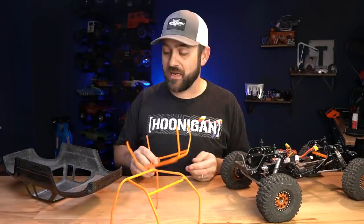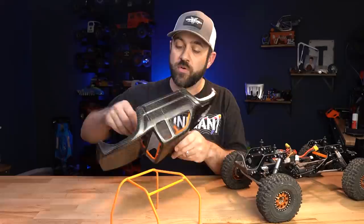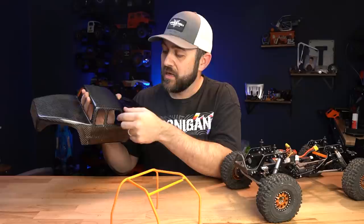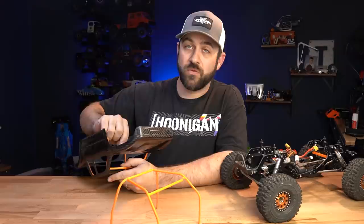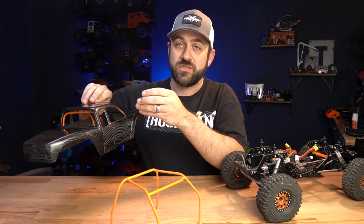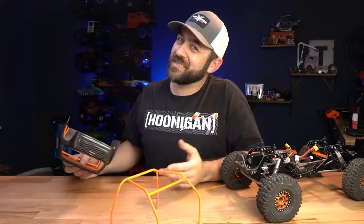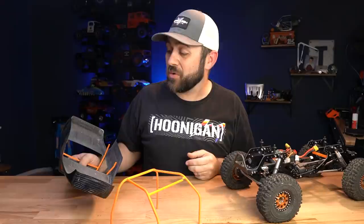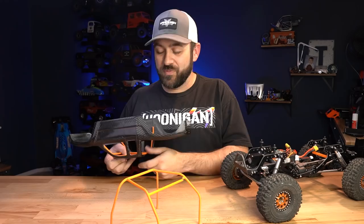I still need to finalize this — one of those things I haven't gotten back to after the last print, to make what I hope are the final round of changes. The whole point of this roll cage is to support the roof line and the A-pillar. The A-pillar is my biggest concern — I don't want to blow out and destroy it even after fabrication. I may use 3D printed filler pieces to help transmit forces from the A-pillar to the roll cage. Then I have to decide: titanium cage or DOM tubing? Titanium has been a trend in these builds — harder to work with, but fun. Titanium or DOM steel — you guys throw your suggestions in there and try to sway me one way or the other.